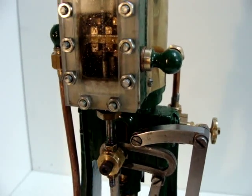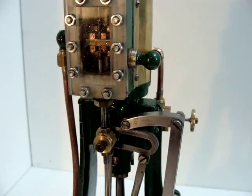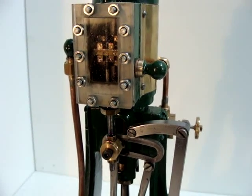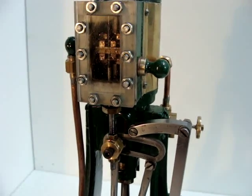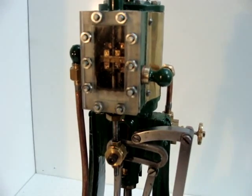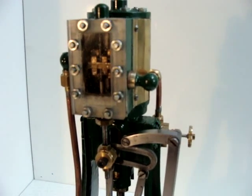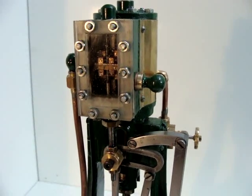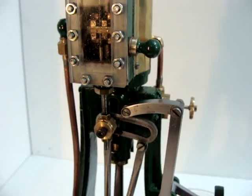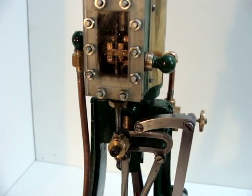This was found to be particularly beneficial when fitted to some of the early steam locomotives. Once the train was moving and at speed, the valve gear could be notched up — in other words, the travel of the valve reduced to restrict the amount of steam being fed into the cylinders, thus improving efficiency and assisting the boiler to cope with the demands made upon it.